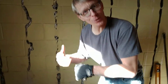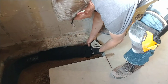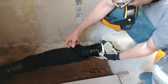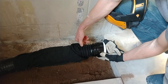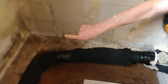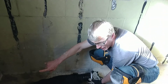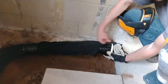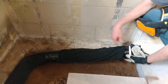Come see, come look. I improvised and used drain tile with slits so that it can absorb and take in water. We'll be putting pipes in the bottom of the wall, as I've been instructed and advised — I didn't come up with this plan. It's covered with a sock to keep debris out, and will be covered with rock from the bags behind you.